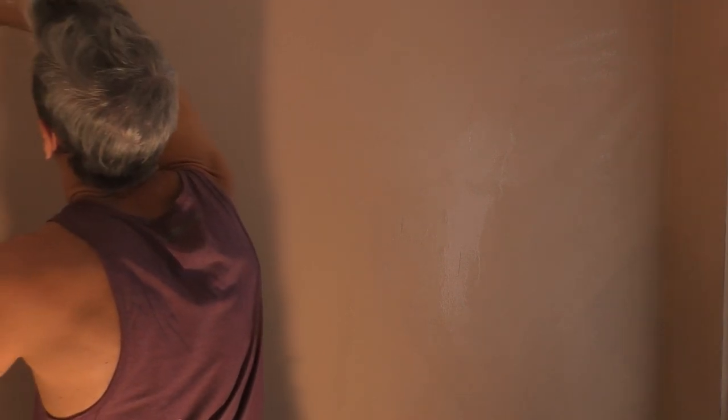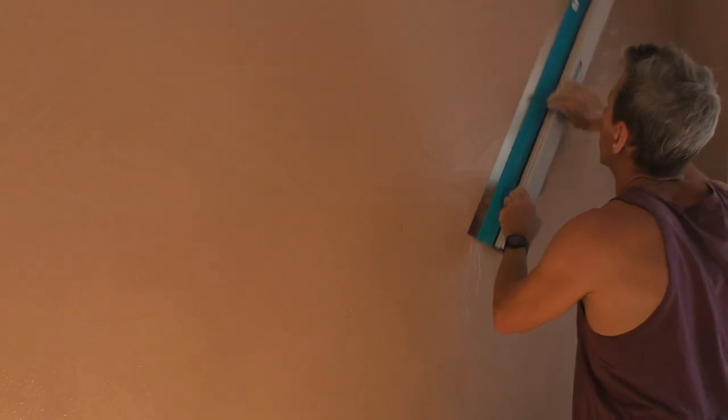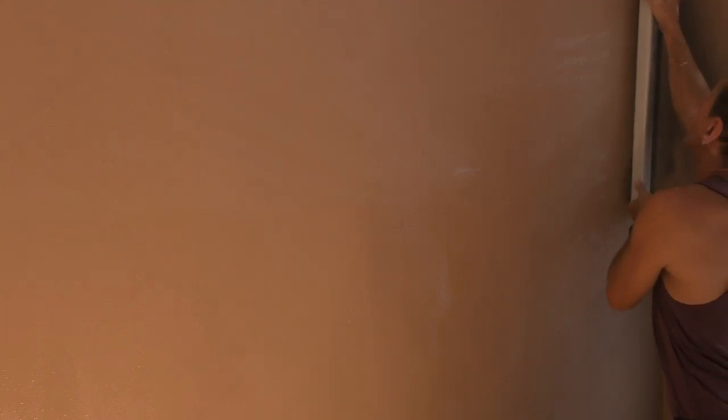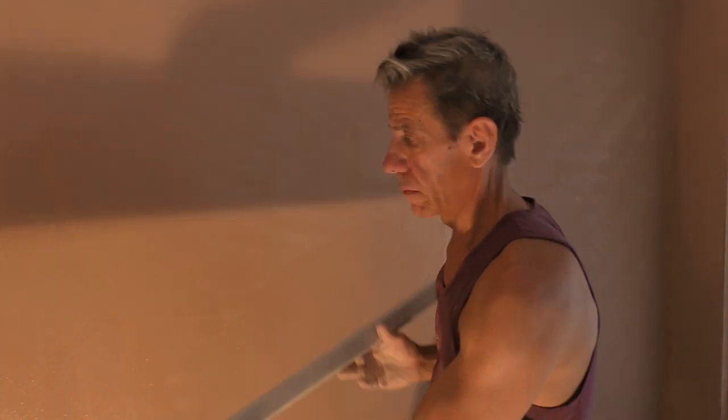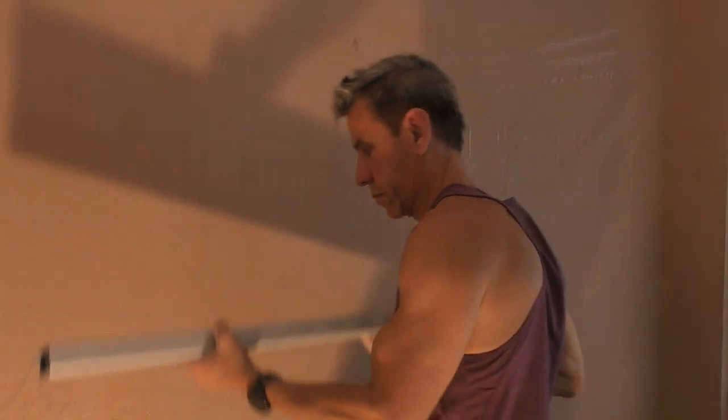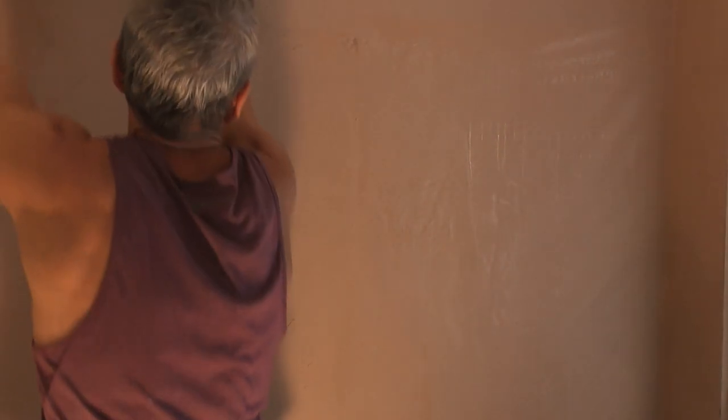This basically just works as a large two-handed trowel - fantastic bit of kit. Just remember as you would with the trowel, do this in all directions. It does give you a lovely finish - as I say, it's a finish you probably could leave without using a flexi trowel on top afterwards or your Marshalltown and it would look fine with a coat of paint. But I've never tried it yet because I still like to go over this after this stage with my flexi trowel - it does give it that lovely silky smooth finish at the end.